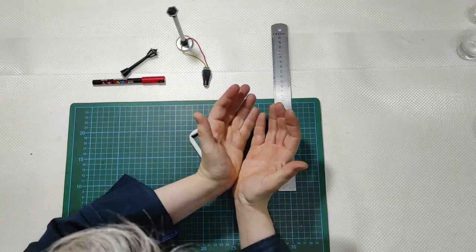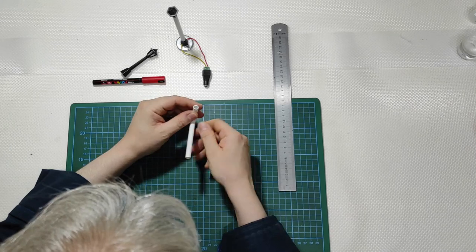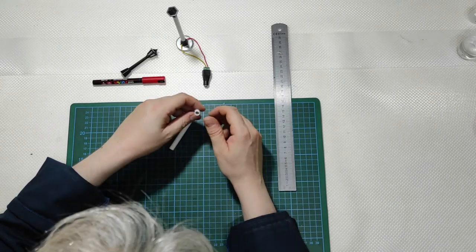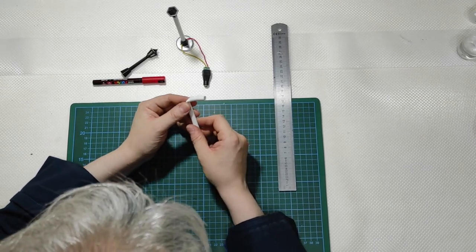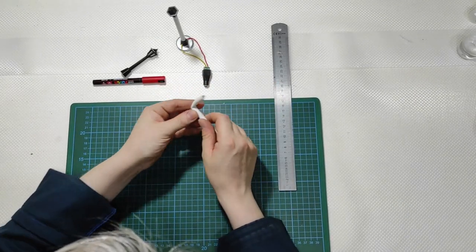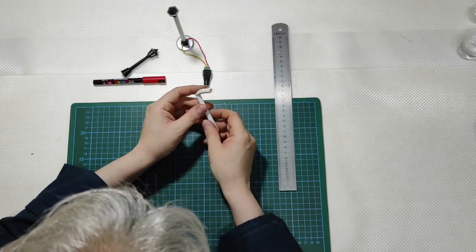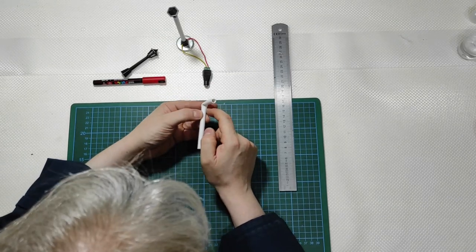I have a container with very hot PVC in fluid state, and I will push it towards a hole with a pin inside, okay? So this will make a pipe, a pin inside with some difference of diameter, and it will get extruded. This is an extruded pipe. But when I reheat the pipe, it tends to go fluid once again, and fluidity is the state where there is no precise cohesion between atoms. So that's why it tends to go there. Yes, I can bend it. But the atoms will go where they want. And once they regain solid state, because it cools down, you will have a ruined pipe.